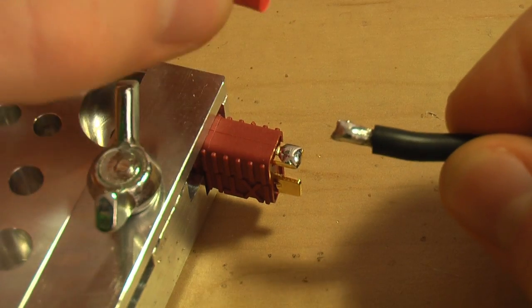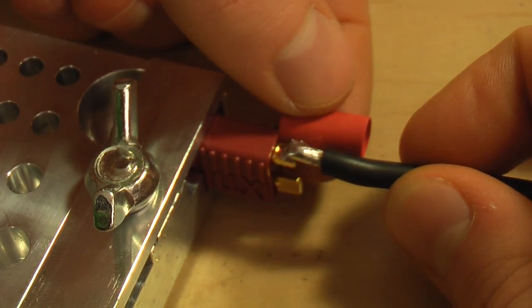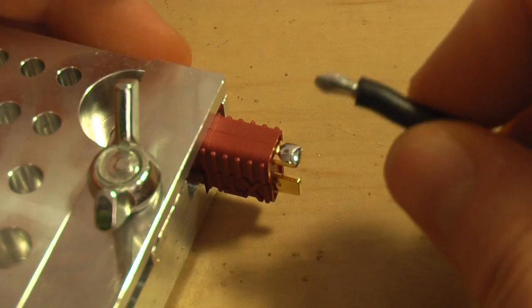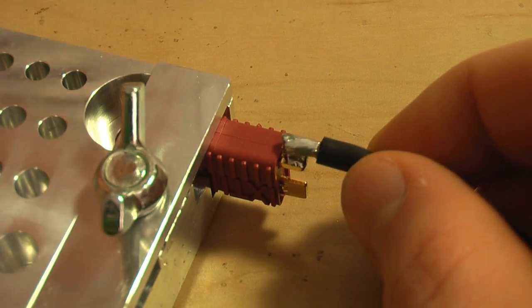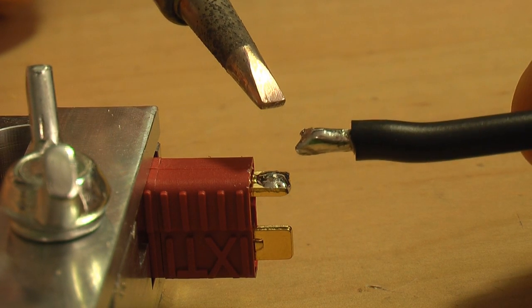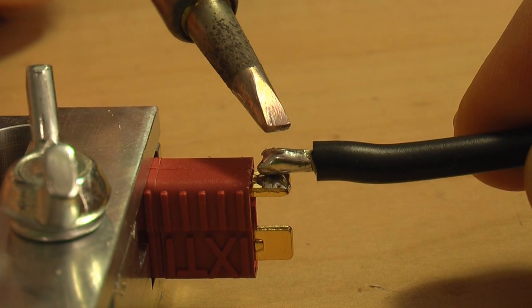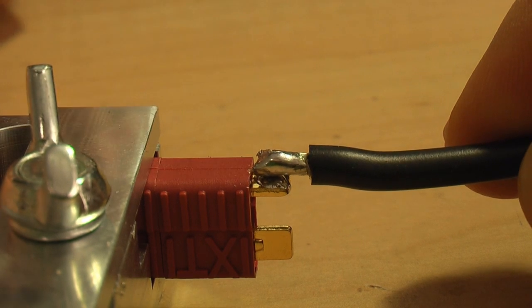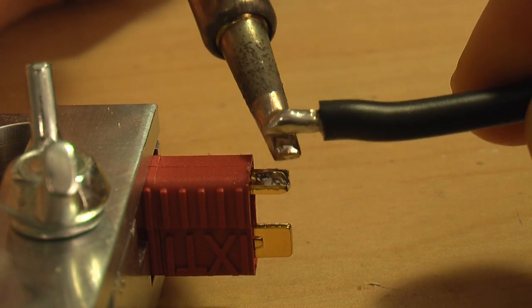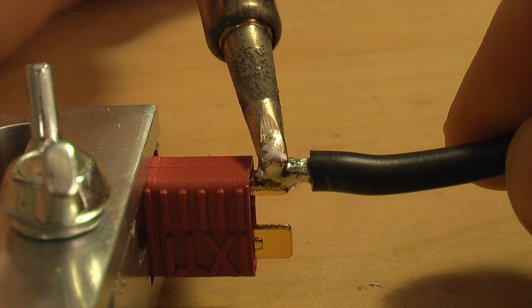Just about like that. This next step is very important: you want to cut a little bit of heat shrink tubing — just enough to cover up the solder joint and then a little bit more — and just slip it on the end of your wire, because once you solder this on here you don't really have access to the end of the wire anymore. What we want to do is heat both the wire and the tab up at the same time, and then once the solder on both of them is molten, we're just going to move everything together, put the solder and iron on top of the two, and just hold it together for a couple seconds and remove the heat. Here we go — heat both of them up, wire usually takes a little bit longer than the tab. One, two — there we go.